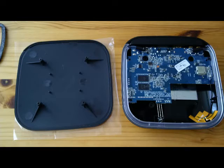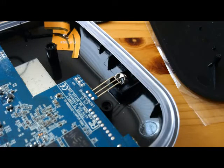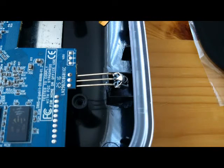If you use a flathead screwdriver and carefully pry around the edge, you should be able to pop the cover off and it will look like this. You can clearly see the photo diode pointing towards the front of the unit, but there is no transparent opening where it could receive a signal from your remote controller.